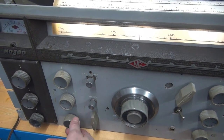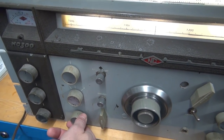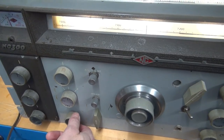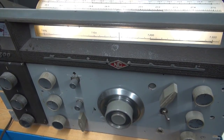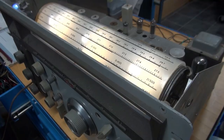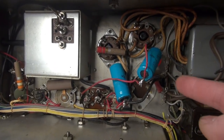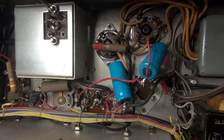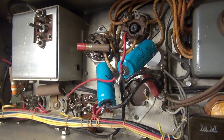I've got a jumper wire off the back of the receiver and I'm just looking for white noise. Yep — I think we've got a dirty pot, but we've got audio. The next thing I need to resolve is that filter cap underneath, and then I'll give this thing a full test.